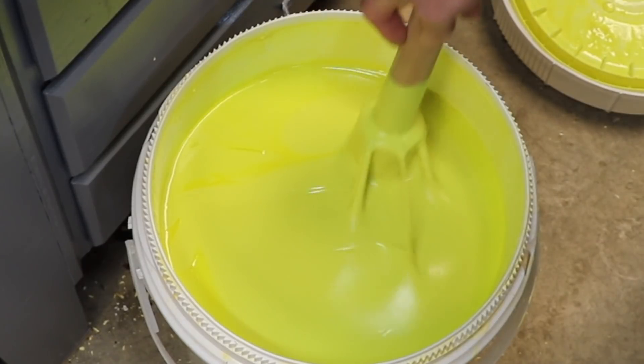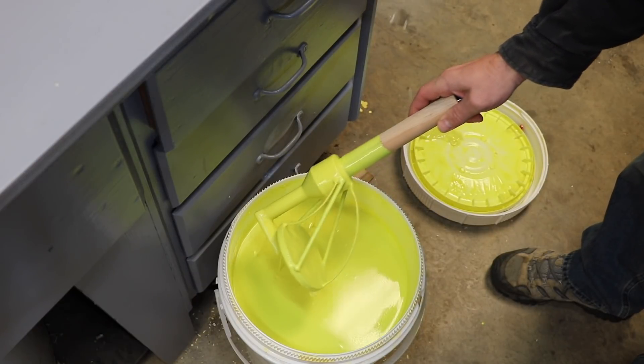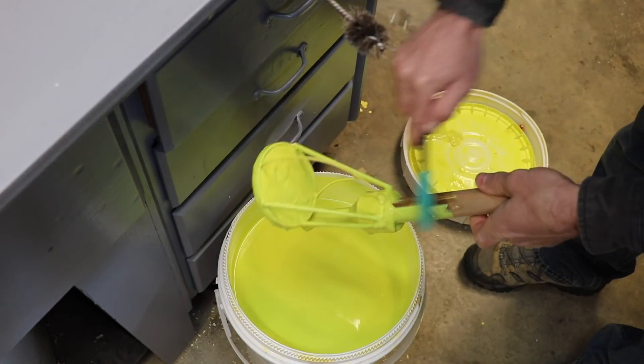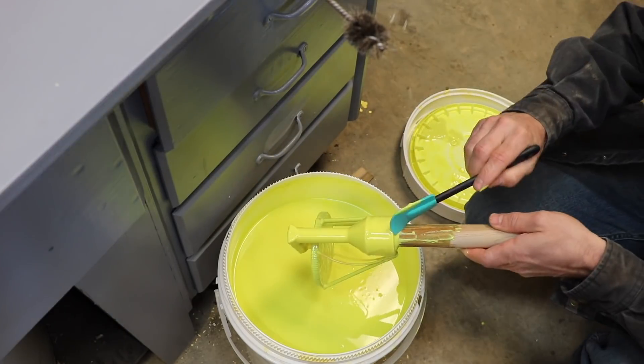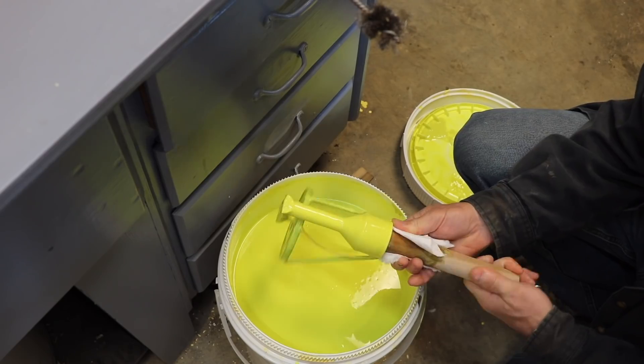I got a real good coat on the second layer, but then I decided that dipping it all the way in like this where I'm covering up the funnel was probably a mistake. So I cleaned it off because I don't want to build up a shell covering up my funnel and then have things end up falling into the mold cavity.